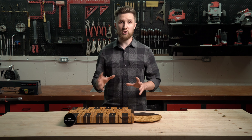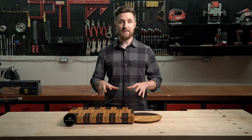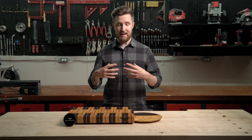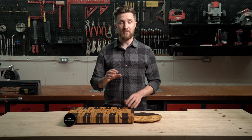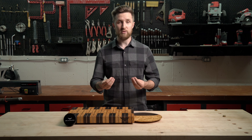The soak will be anywhere from 8 to 24 hours depending on the species of wood. Once it's done being soaked in mineral oil, I let the board rest for a couple of days so that any excess oil can naturally come out. Then comes the next step, where I seal the board with a mixture of homemade mineral oil and beeswax paste.